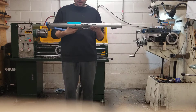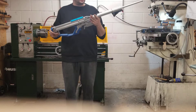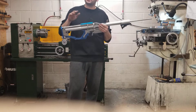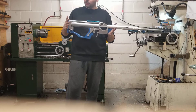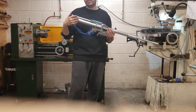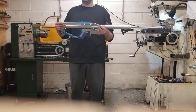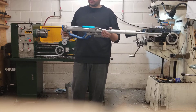Really cool — this is all water jet cut, not hand cut. I'm so sick of that drill press and bandsaw work. Everything is cut out; all you have to do is drill the cross holes and tap them. It's a little more expensive to produce in low numbers, but in volume it's certainly worth it.